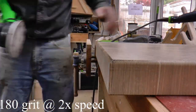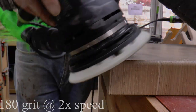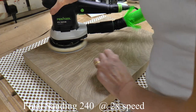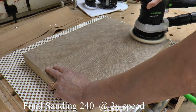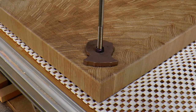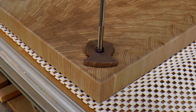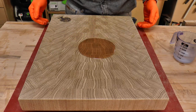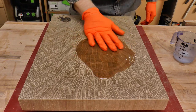I sanded the freshly routed roundovers with 180 grit, before giving the whole board a final sanding with 240. As you can see in this picture, the board looks polished already — and that's before the 240 grit. The last job before the big grain reveal: I put our brand on the bottom of the board. And now it's time for my favourite bit of the entire process. When you pour the oil on the board, the end grain just really pops and comes to life. It makes the whole process so worthwhile.